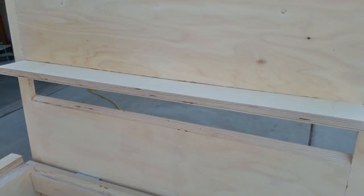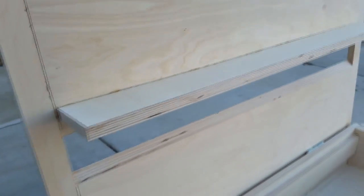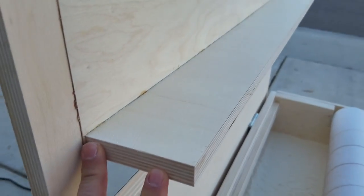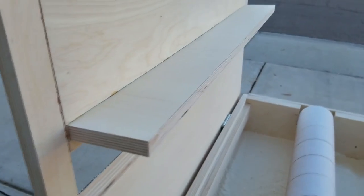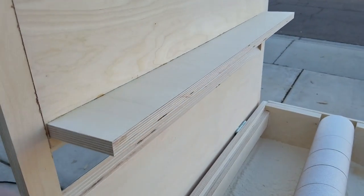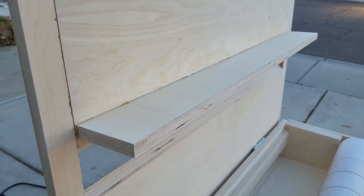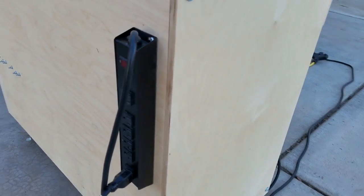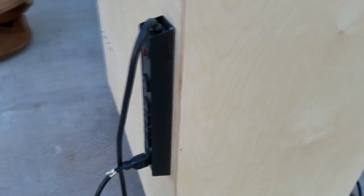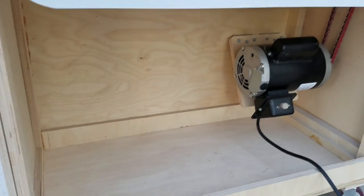On the design of the top, one of the important parts was that you don't want the top to sag. So I put this member in here at 90 degree angles to the top — it's pretty wide — to prevent sag so I can do a good job of flat sanding. I just use an electrical strip screwed onto the wall of the sander for electrical supply. It plugs into the wall and then the motor itself plugs into this strip.